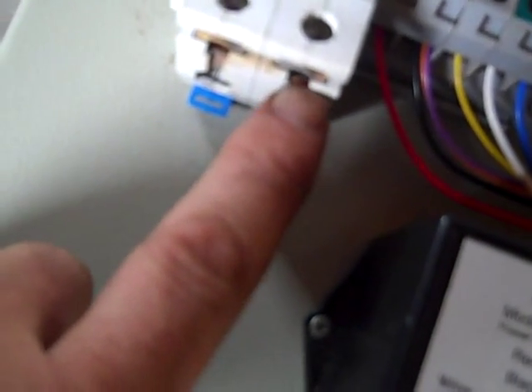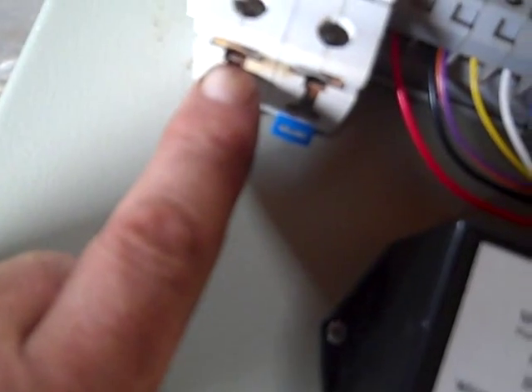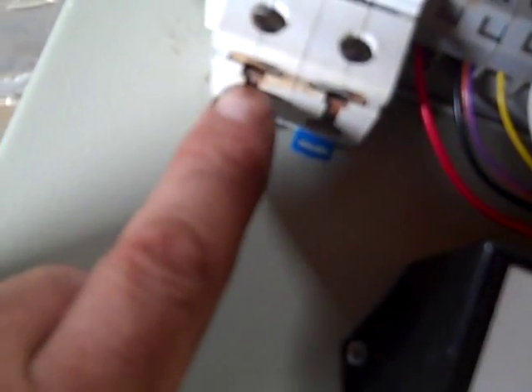I'm wiring it according to the diagram and protecting the motor with an inline 10-amp paper fuse. I've got breakers and terminal blocks from my old solar pump setup — these terminal blocks are really neat, though you can just use simple bus bars. I'm making sure I've wired it correctly: solar panel positive on the right, negative on the left, feeding the terminal block with the right wires.